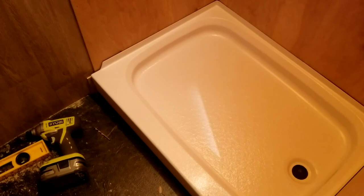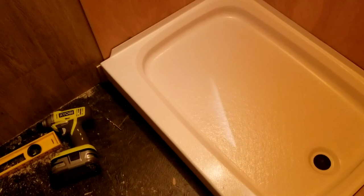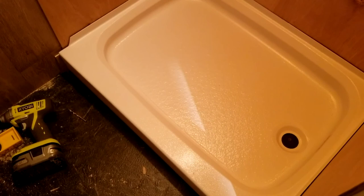It's going to be a little bit tricky here because I've got metal under the trailer that is like a case. You'll see when I show you later. I could actually put the P-trap underneath it, inside the metal case, and then run my plumbing out the side over there. What that means is that I have to run the plumbing from underneath the camper, actually.